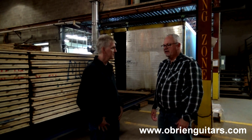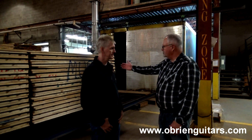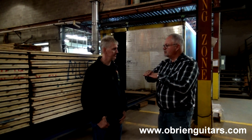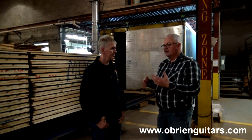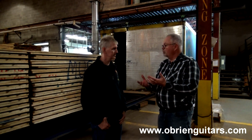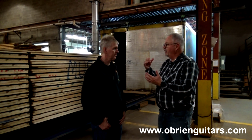Well, the process is that our oven takes 14,000 board feet in one shot. What we do is we prepare it, as you see the wood behind us here. It's prepared at 2 inches thick, so we take two 4-quarter boards, put them on top of each other, and then we sticker in at every 12 inches in between. The reason why we do that is that our heat source comes from propane. We transfer the propane heat from the flame through a thermal oil that we pump into a radiator in the back of the oven.